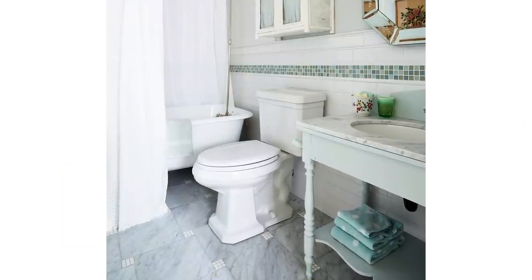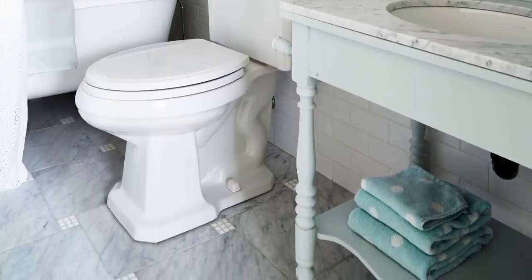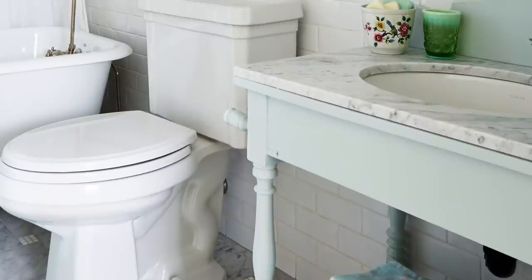Next, how to take a super simple table — the kind you'd find at a flea market, consignment shop, or yard sale. You may need to paint it. Use latex paint: prime it first, sand it, give it a coat of primer, then a couple of top coats. For an extra durable finish, add a finishing coat of urethane. If you have time, this is a great DIY project — I often have things custom spray painted, but you can definitely tackle this on your own.